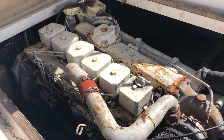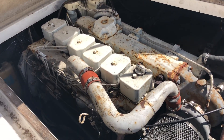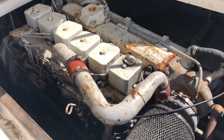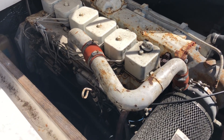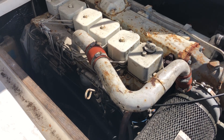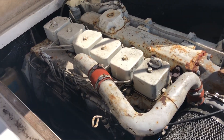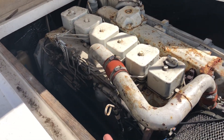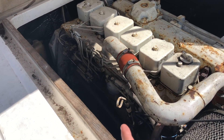Here I have a Marine 6BT. This engine recently had its fuel filters changed, and after changing the fuel filters and starting the engine, the engine died approximately 30 seconds after running. What happened was it drained out the fuel from that secondary filter.